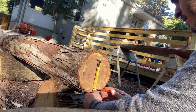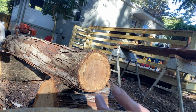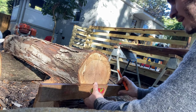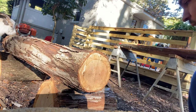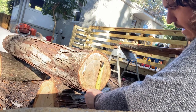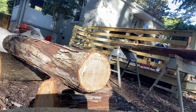Now all you have to do is make sure that you have a good 6 inches from the bottom. And it looks like I might be able to get away with this, although not quite. Okay, so this is going to be a bad line now, because what I like to do is essentially just a process of trial and error. I'll see if a line goes here, am I going to be able to get a good flat surface on the bottom at 6 inches? And it doesn't look like that's the case. So basically, I can just move it up a bit. And actually, you know what? That's not too bad. We're going to call that good. Okay, so now we have roughly a 5.25 by 6.25 log. Not too bad, but most importantly, I'm going to be flat the whole way.